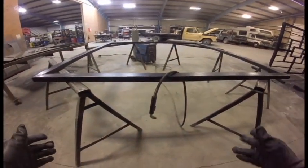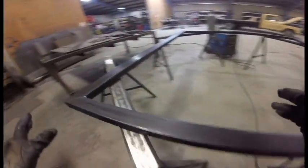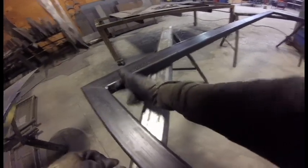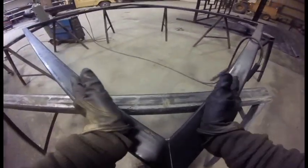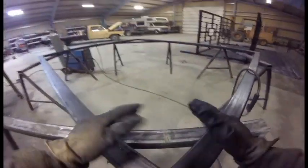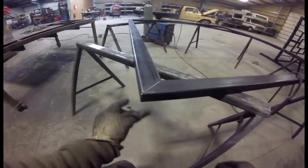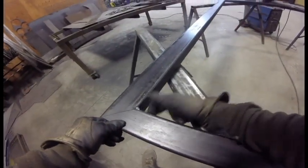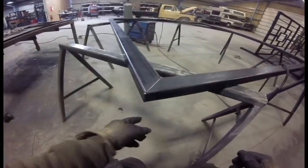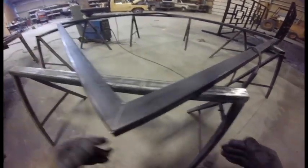As I said before, if you're a welder, you know what I'm talking about. Well, here's what I'm talking about. If I were to weld the inside corners of this frame, if I weld this one, when the metal cools, it contracts. And so it would squeeze these together and push the whole thing out of square. If I were to weld the outside edge, it wouldn't do it quite as much because there's not as much for it to grab onto. Whereas the inside, there's those walls. The outside, it won't grab as much. And so it would pull it out this way, but not as badly as inward.